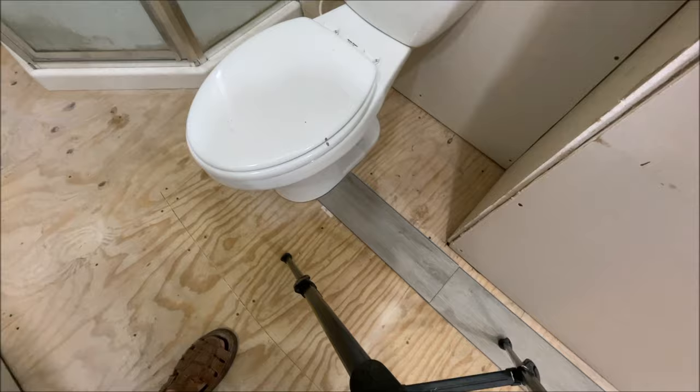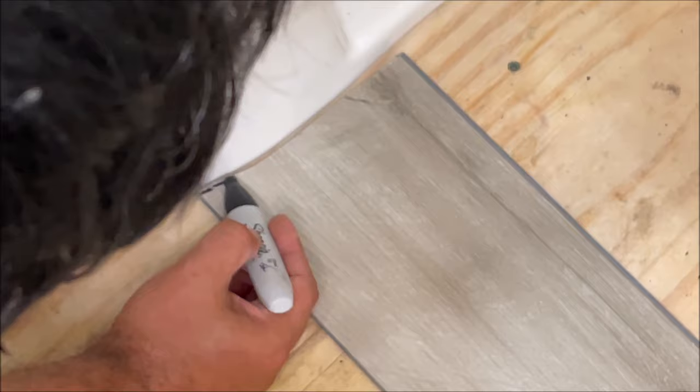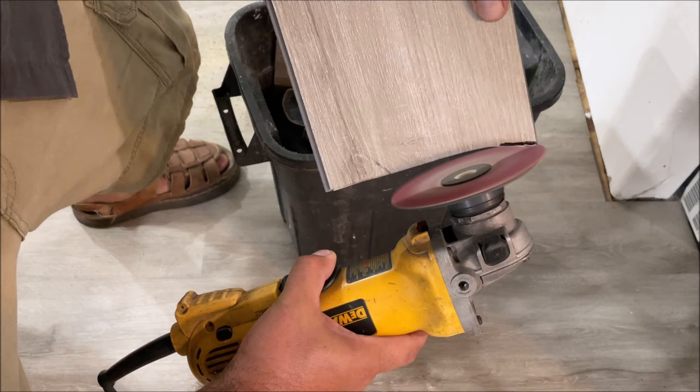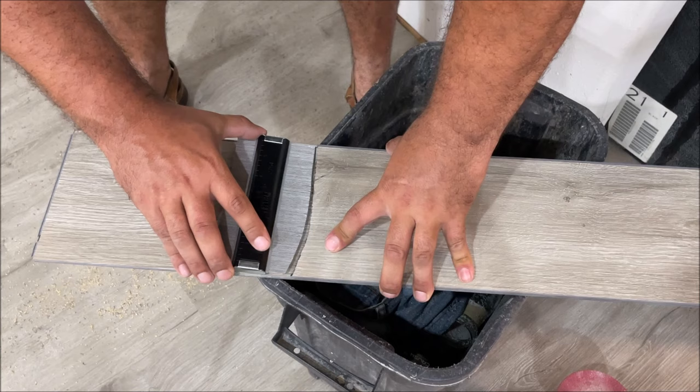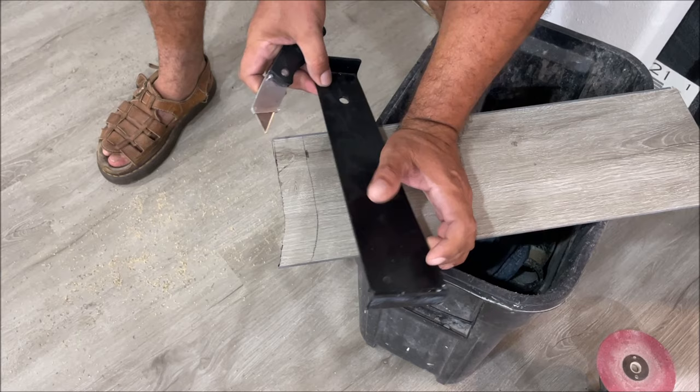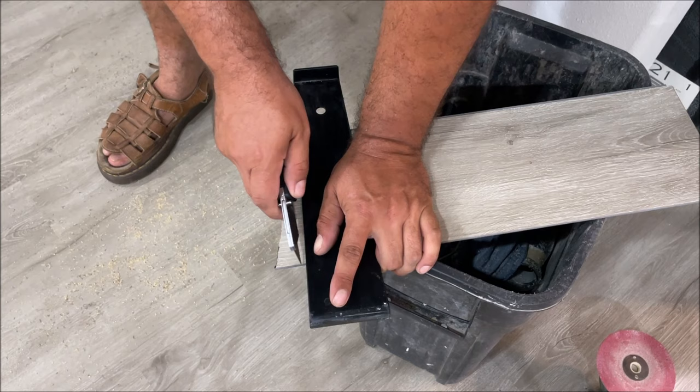Trying to score a curve cut is not a good idea, but we did not damage it — let's check our fitment. It looks okay from here but it's actually not good enough. We take our Sharpie, mark where we need to trim a little bit. Our official measurement off the toilet was 17 and a quarter, so a safer way would be to score it straight and then sand out that curve.